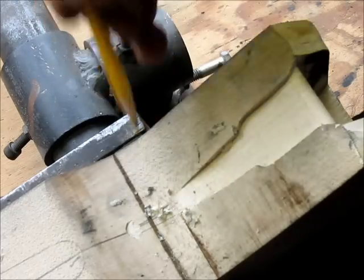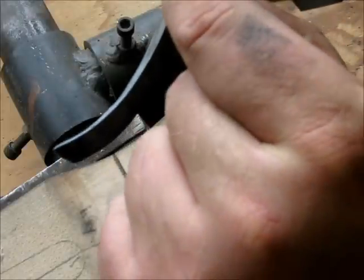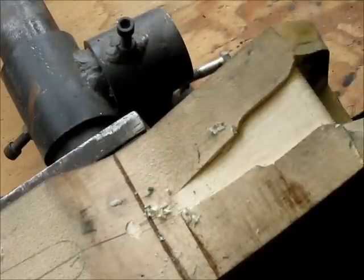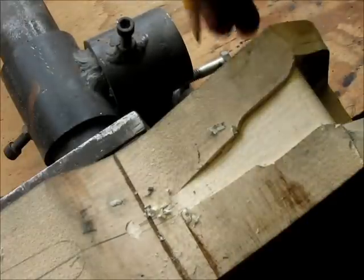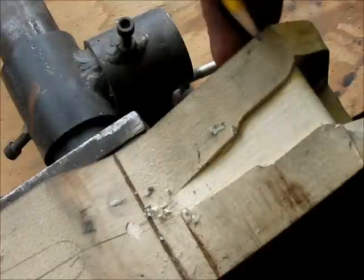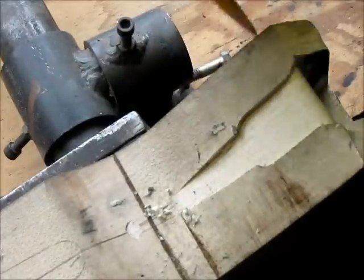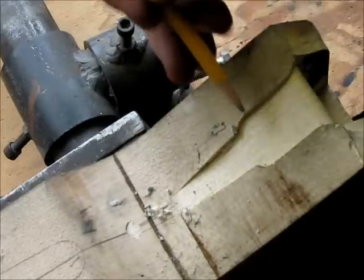And so in order to increase this depth down to the full thickness of the tang, basically, or close to it, going 2 or 3 thousandths at a time over the course of a quarter of an inch or so, and that's actually a little thicker than a quarter of an inch, what it actually means is that's several hundred passes, touchdown and scrape, touchdown and scrape, touchdown and scrape, several hundred times to make that depth.